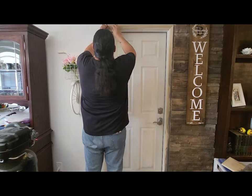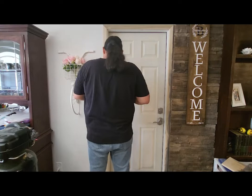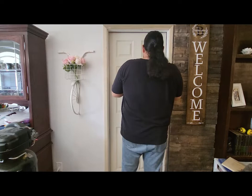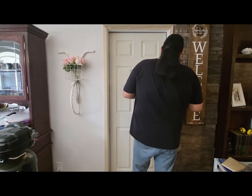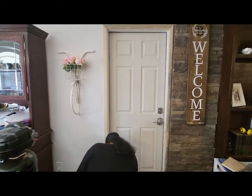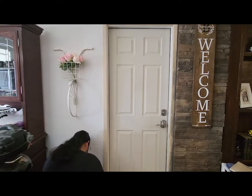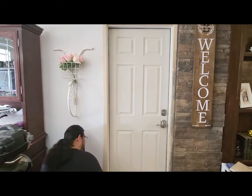Here I'm just using a spring-loaded nail set to seat a few of the brad nails that weren't quite sub-flush, then filled all the divots with wood filler. I had originally planned to use paintable white caulk along the seam of the trim where it sits on the drywall, but once everything was installed I realized it wouldn't be necessary — the trim sat almost perfectly flush against the drywall with only a couple of barely noticeable voids. So instead of going to Home Depot for caulk, I ended up just filling those little voids with some joint compound I already had laying around, then cleaned it up with a damp sponge.